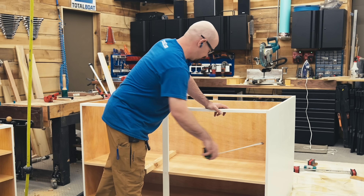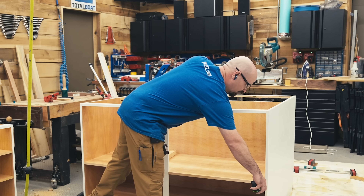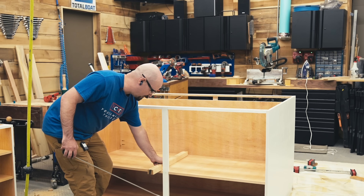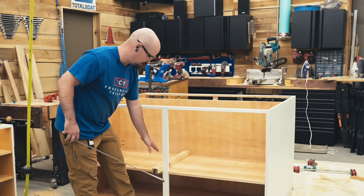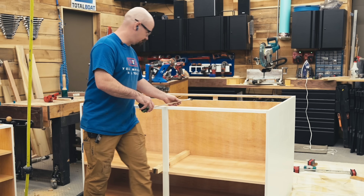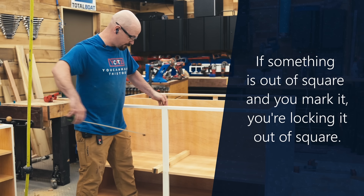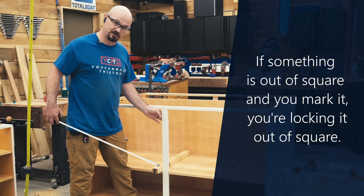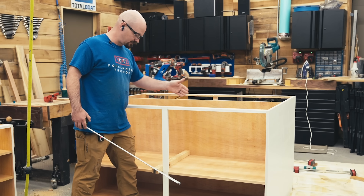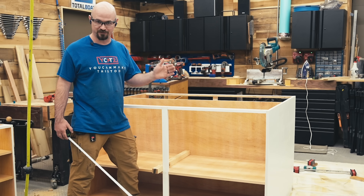One of the things I want to do — and this applies even if I had to take the mark up high — is make sure everything's square. I'll pull a measure back here, come in here: same. Now I know if I mark here, I don't have to adjust this piece and it's going to be good. If something was out of square and I pulled a measure or marked from it, all I'm doing is locking it out of square. So always be mindful of where you're taking your mark from, and find the best place to make your measurement or mark.